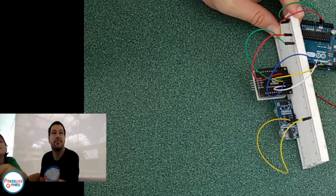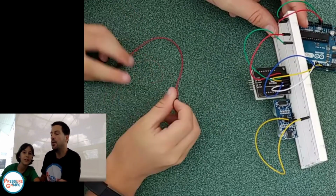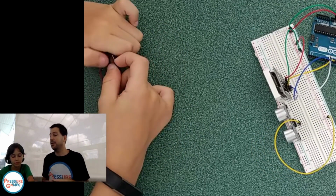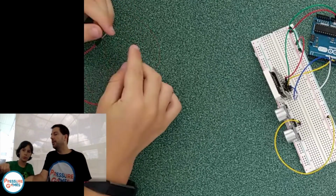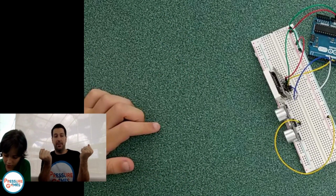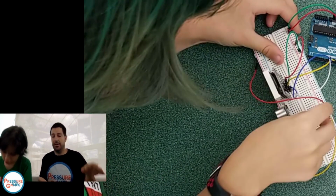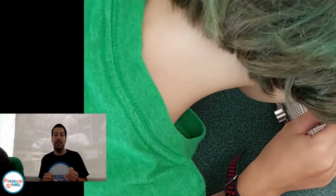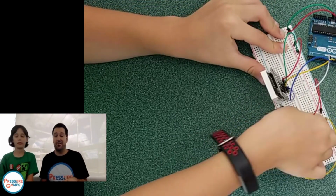Brandon Kirk says, "What happens when you do that?" It's a good question. Let me explain what he's asking. If you connect power to ground, then you have what's called a short circuit. You have what's called a short circuit, and the power goes immediately to ground, and things get really hot, and something can break. If you have this hooked up to USB through your computer, let's say, you can hurt the USB port on your computer. Generally, the USB port on your computer doesn't supply enough power that it can do anything of damage. It can't even usually hurt your USB port.